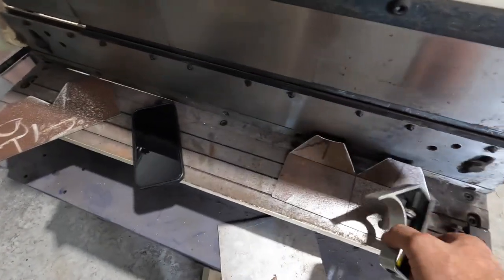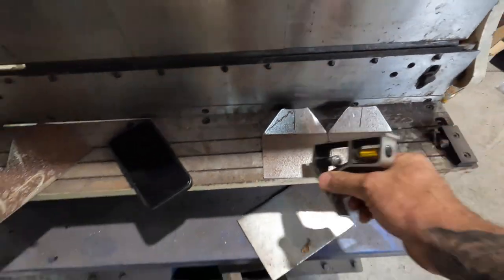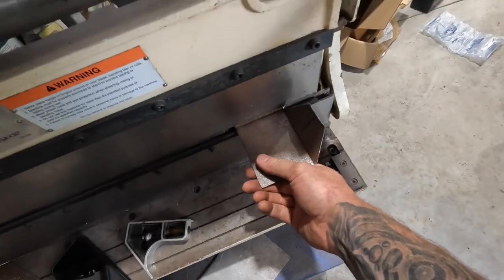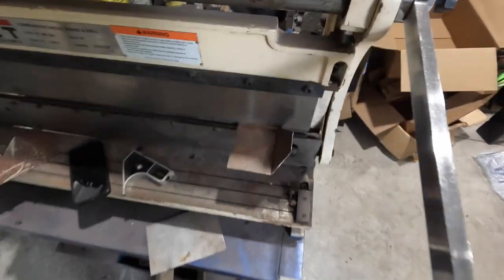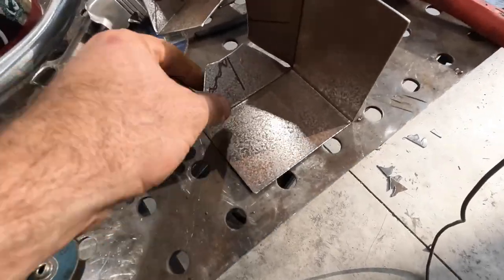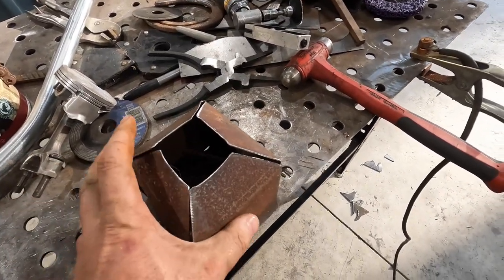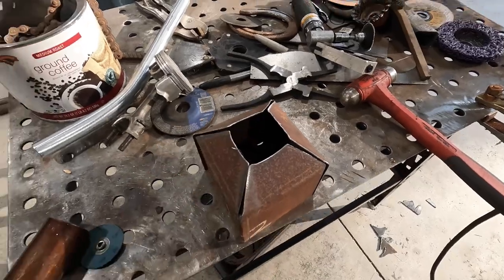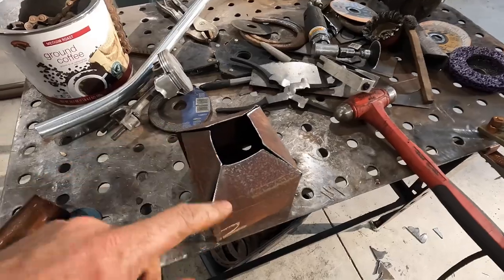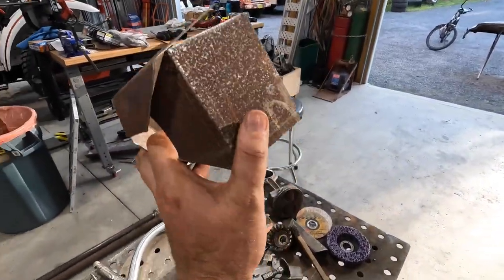We go ahead and check it — we can adjust it the other way. I almost got it perfect on the first shot. I've got two of these to bend, then we go ahead and put it in for the 90-degree bend, put the two halves together, and head over to the weld bench. We've got two halves with a weld here and a weld here. We're going to make sure it fits up on the bottle and weld our 45 bends as well. A little bending, a little tweaking, and we'll hopefully end up with what we want — and we'll cut some flames in it.